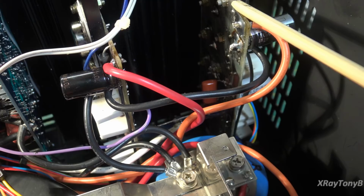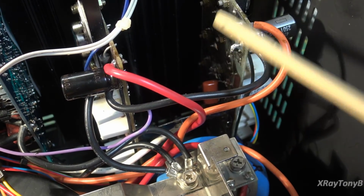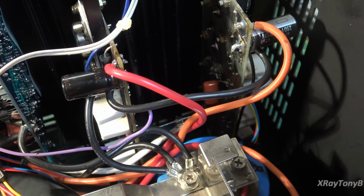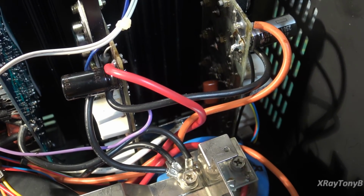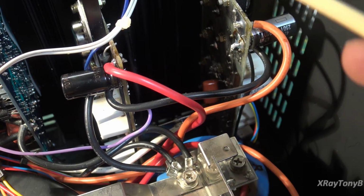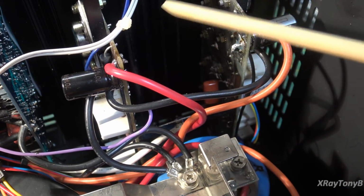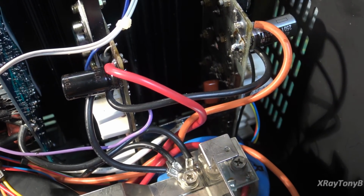The bottom line is I did not have an exact replacement transistor. The transistor in here, it's a 2SC, I think 3478, and it's a very difficult one to find. There's very little information online about suitable replacements. I tried a transistor that I had that the characteristics matched up, but that almost never works. So we're going to try it. If this side won't bias up, that's almost certainly going to be the problem, and we're going to have to try some different transistors and some methods to find one that will work.